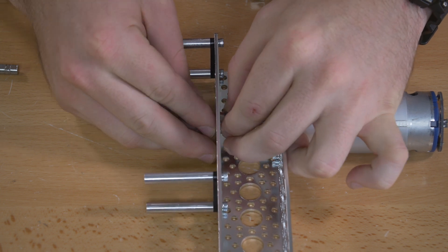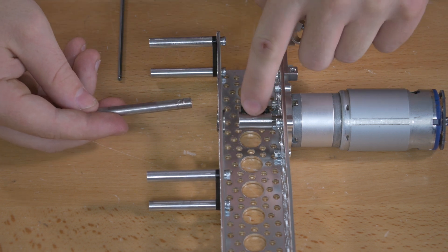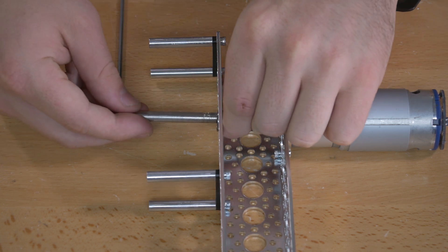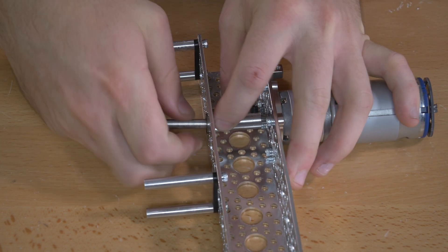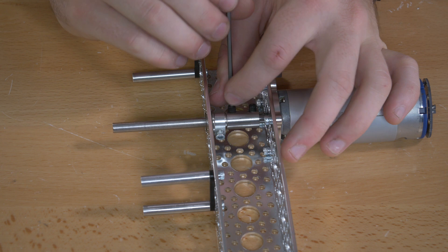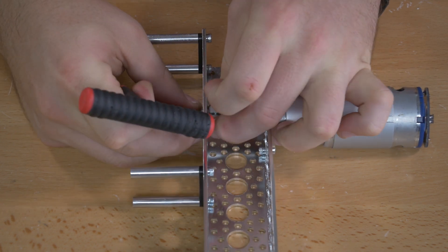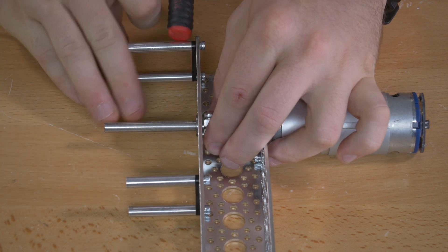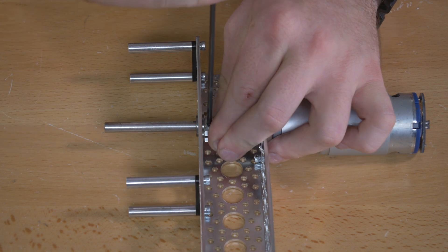Then place your D shaft through that ball bearing. In between the ball bearing and your set screw collar, add a clamping collar — that will slide inside and your shaft will go through both of those and into the clamping collar. Once that's in, tighten the clamping collar using the 3/32 inch hex key so that the ball bearing is all the way into the channel. Don't tighten it too tight or you might restrict the movement of your shaft. Place it up against the ball bearing and use the 7/64 inch hex key to tighten it in place.